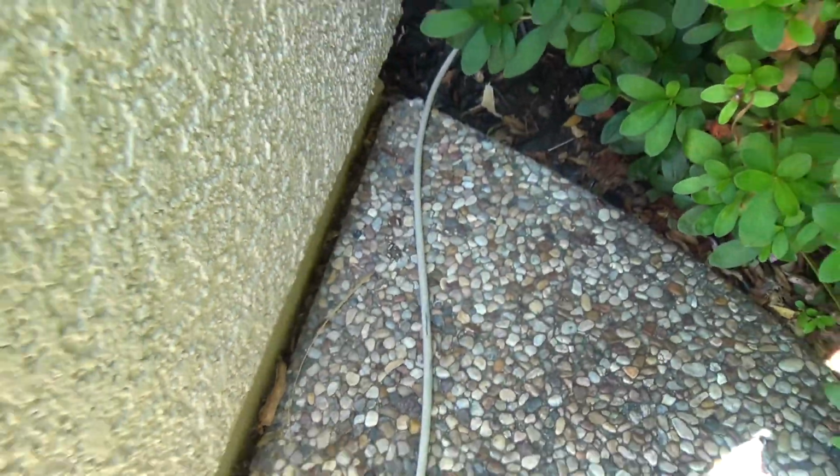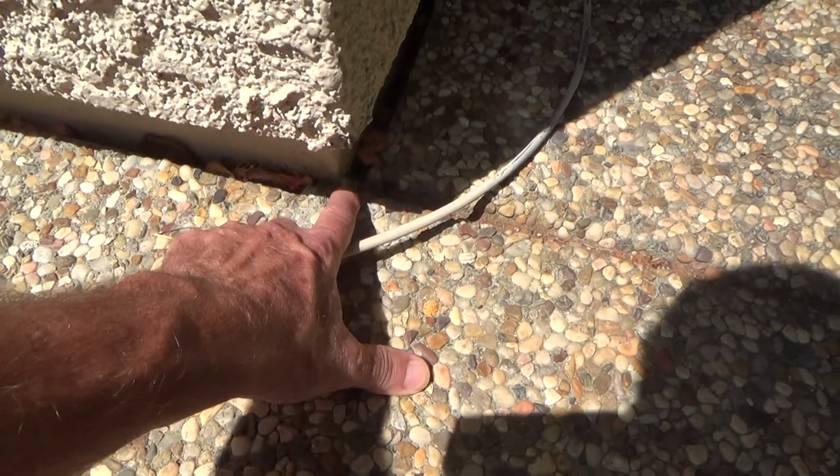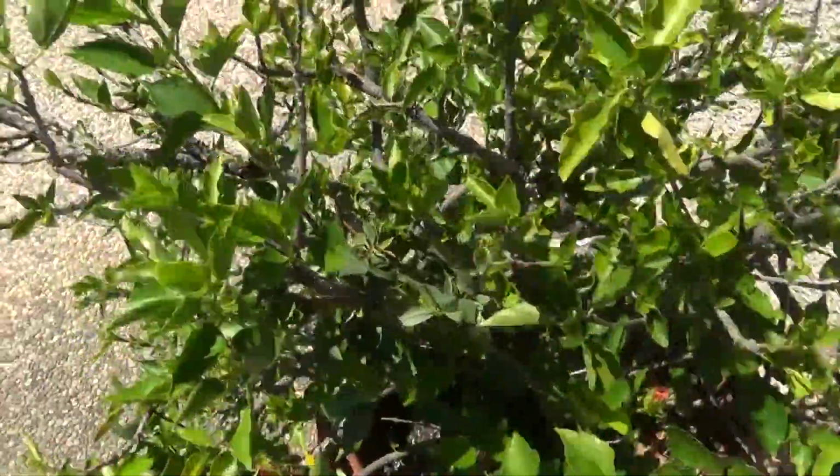Look at that. And besides, here's the felt under here, so I'm going to dig this out over to here, refish that in, get a new length of pipe, and I'll save this one. I could save this one for anything that I'm going to bury underneath the ground, for some other time. I'll have to dig this out. I think I can chop that concrete out of there, so I can put a 90-degree elbow on there and come around the corner and then zip up a new piece there. But that's not in this video.